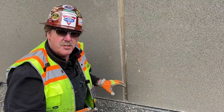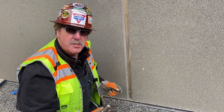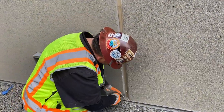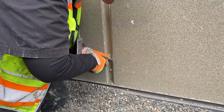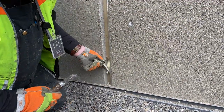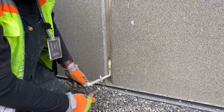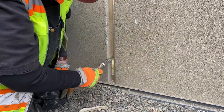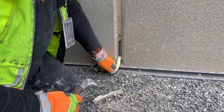We're going to do another inspection, this time of the weep tube. It should have a trough connecting the primary to the secondary sealant. Let's see what they've done here. So here's our weep tube — in there. Sound effects there, huh. Now let's see if there's a trough back there — absolutely nothing there.